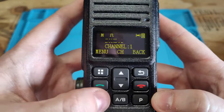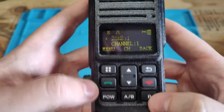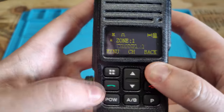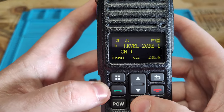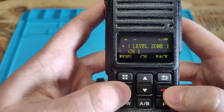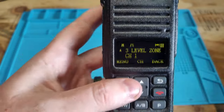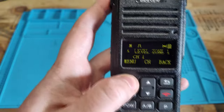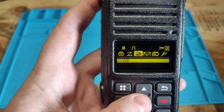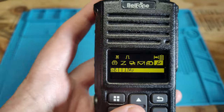Going to our front keys: our POW is our power key, so we can get into our power menu and change the level. The P key is kind of a neat key — it will bring up a large battery indicator showing the battery level, currently at 100%. Our A and B keys will change us between our A and B zones. Then our call button will take us into our call log. In the menu we have our address book, scan list and settings, zone settings, text messages, call log, and our general settings.